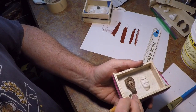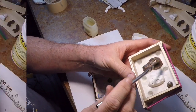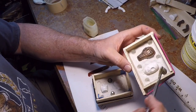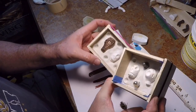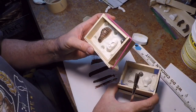I don't want to have any more pewter at the parting line than necessary. These are called registration points. What I did is I just took the end of the sharpie and jabbed it down in there, and I also use these acorn nuts — that's another way to do it. I've got a couple of them here, and then I have four registration points around the perimeter of the robot heads.